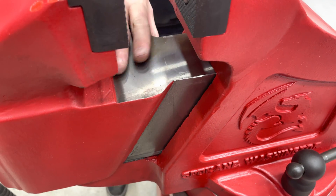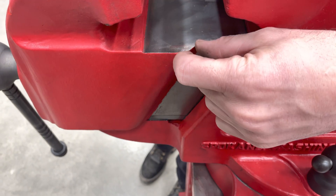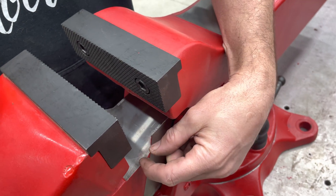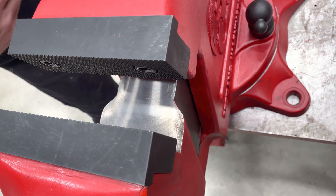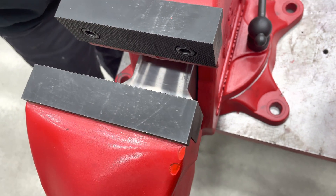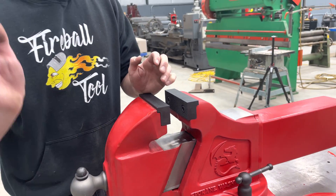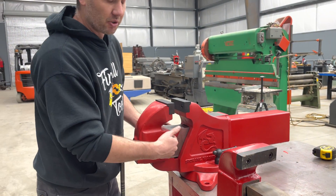What you do get is a lot more strength, but what you sacrifice is that extra three-eighths of an inch of clearance when you're flying a long piece of material down the jaw — you lose a little bit of jaw stick-out. It's one of those trade-offs: strength versus functionality. I would rather have the tool last longer and give up three-eighths of an inch of clearance, knowing the vise is going to last whatever you throw at it. So this was the improvement and the solution to the problem.